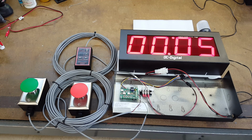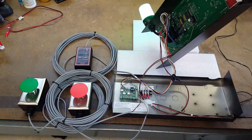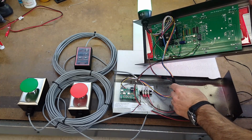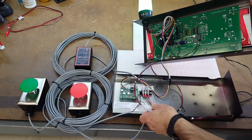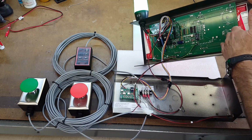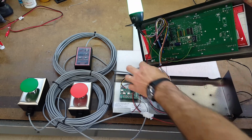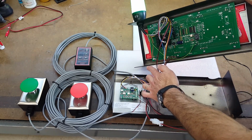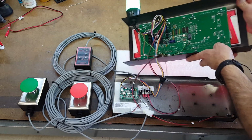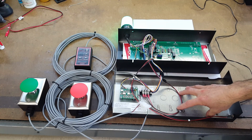I'm going to show you the enclosure and all its inner workings. These are modular connections. We have a 6-pin, a 3-pin, and the power connection, and you can separate this front part of the enclosure from the rear part. There are 2 slotted screw channels, and there are 2 regular holes. The slotted ones allow you to line up the front to the back portion of the enclosure.